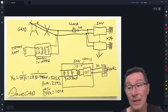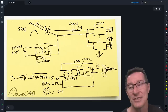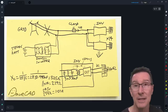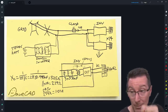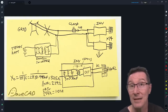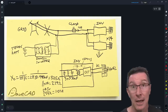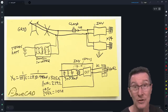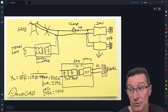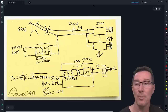So 1.1 amps is real. There is a potential downside to having a ton of these micro-inverters: you will get I²R copper losses in there, there's resistance in the wiring. But you will only dissipate real power in those copper losses — there is no real power at all dissipated in these capacitors. So if you went out and got a thermal imaging camera and put it on those micro-inverters at night, even though it's 280 VA apparent power, in theory you would see no power dissipation in the micro-inverter at all — just a little bit of wire heating from I²R losses.